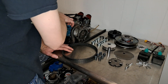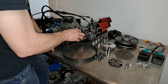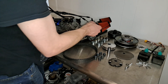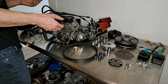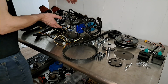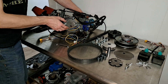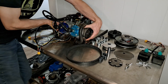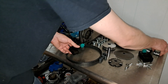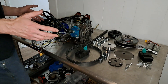We're going to be putting this twin-cylinder two-stroke on there. This is two pocket bike motors with AF-18 Honda Dio intake manifolds that have much better reeds. I've done some custom two-piece adapter plates. These are PWK 21-millimeter carburetors with some cool-looking pod filters, high-compression cylinder heads, full-circle crankshafts. The ignition setup is a homemade flywheel and a piece I machined on my little CNC to mount these pickup coils. These are running off of two DC-CDIs for a two-stroke Yamaha Jog scooter, each powered by two 3S LiPo batteries, and that seems to do okay for spark.